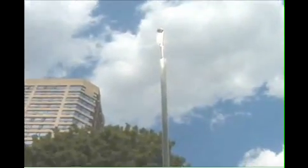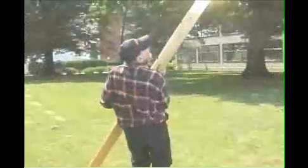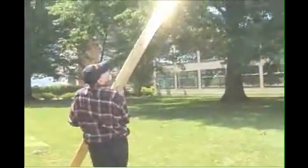One interesting note is that these are flat pieces of mirror — they're not bent in the height direction. They're obviously bent in one axis but not the other. That means that rather than producing a point of light, we're producing a bunch of 10-inch strips of light.